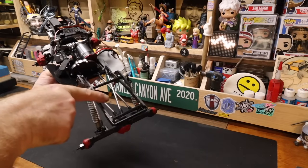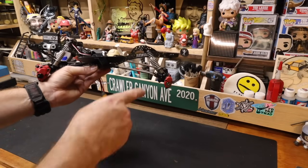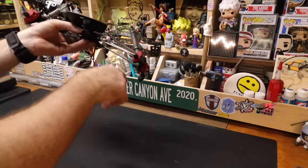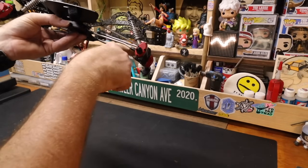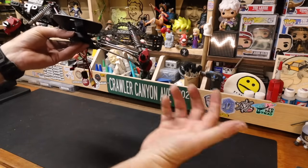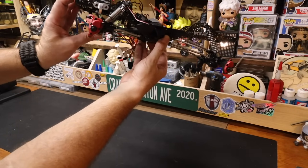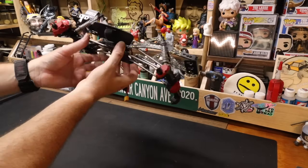Had to get the rear uppers to about 148. See, that's the pinion angle I want. I want the pinion angle to be roughly parallel to the lower link so that the drive shaft is above the link. We want the links and the pumpkin to be the lowest things. If we go through the stroke like that and the pinion and therefore the drive shaft drop down below, that's not good. You're just gonna bash it into rocks all the time. So this guy in the front, he's right at the limit, but under compression, he's clear. So we'll see how scratched up that gets.